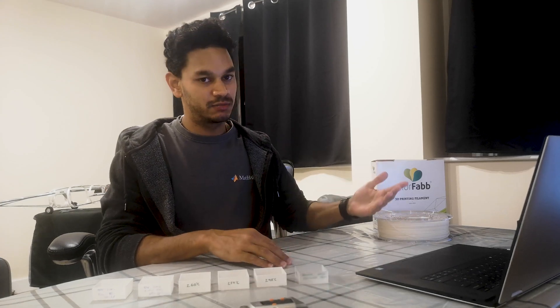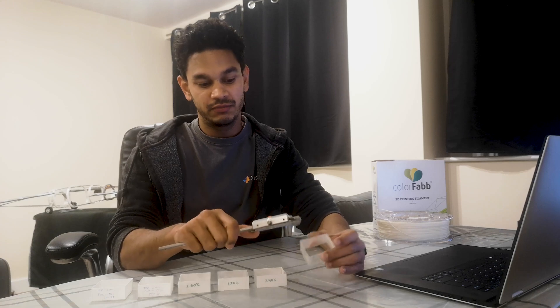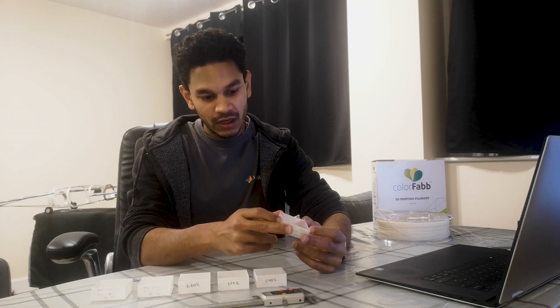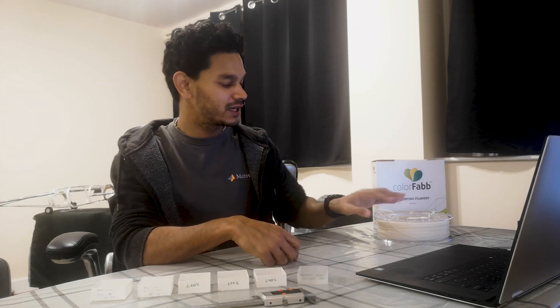This material is not something you can just stick in the printer and click print — you do have a bit of calibration to do. The first thing you'll need is a vernier caliper to measure the wall thicknesses of the calibration cubes you'll be printing. I made my cubes 50 by 50 by 20 mm, since I only had a 750-gram spool and didn't want to use the entire spool just to calibrate.